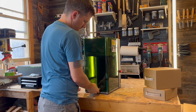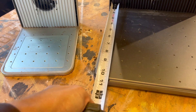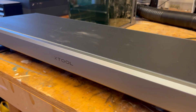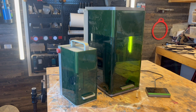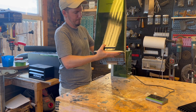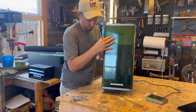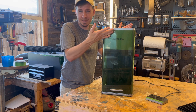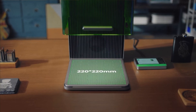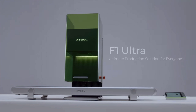There are not many desktop lasers similar to this style and design that can compete with the variety of things this laser can do, and it doesn't just surface engrave — it can get a nice deep engraving. In reference to its size, it's about 10 by 14 by 20 inches. The working area is 220 by 220 millimeters, or 220 by 500 millimeters with the automatic conveyor. It comes in at 32.4 pounds, whereas the original F1 was somewhere around 8 to 10 pounds.